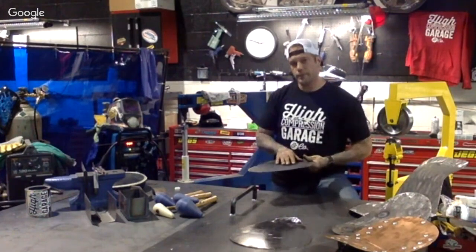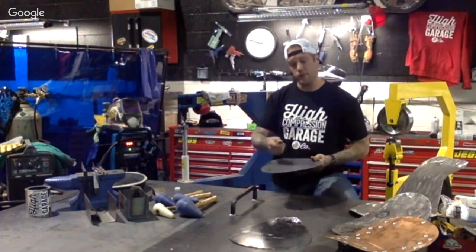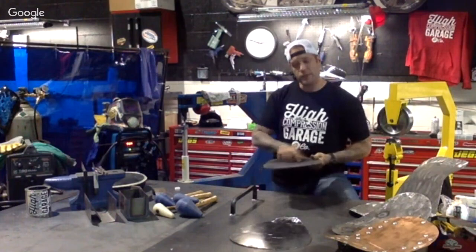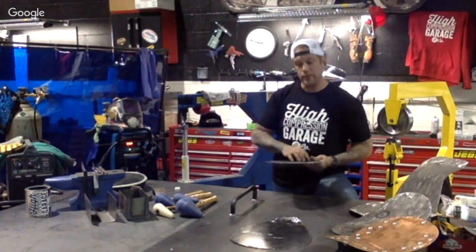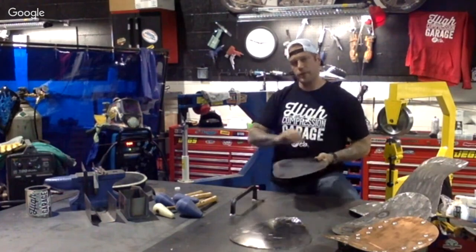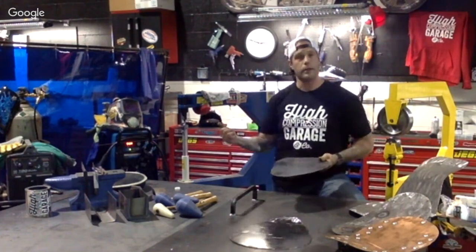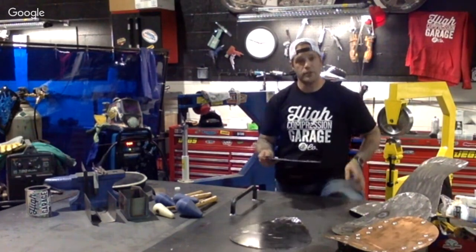But when you do get your metal, every supplier of metal will give a different form on the front. So what I mean by that is there's some kind of film, protective lubricant on top of it, and you want to make sure that that's taken off before you do any of the metal work, allowing for instance, when you're laying down a weld on something, that it is a good working surface that you start with.